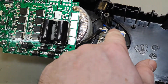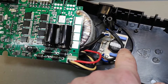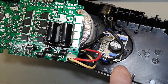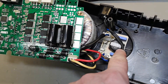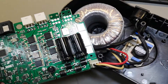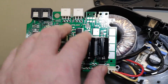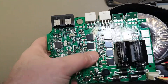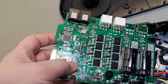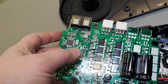There's a mains filter in front of the transformer. I actually don't fully understand why they did this, because I don't really see any switch-mode converters. As far as I understand, they just turn the motors on and off — you've got the two full bridges so they can go backwards and forwards.